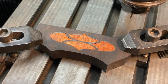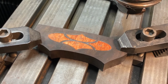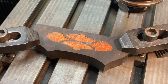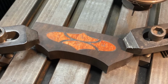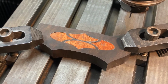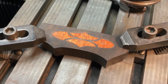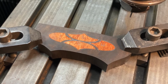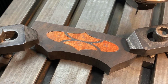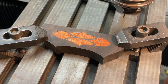And I actually used the oversized stylus and then check fit these before switching to the exact size stylus, and it's a good thing I did because they actually fit in there well with the cut given by the oversized stylus. So remember that. Always start with your last cutter and stylus set with a slightly oversized stylus, and then check fit before moving to the spot on size, because sometimes they'll fit a little earlier than you had predicted. Anyway, that's one side done on the Pantograph.